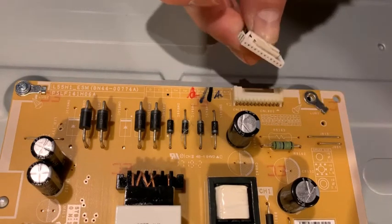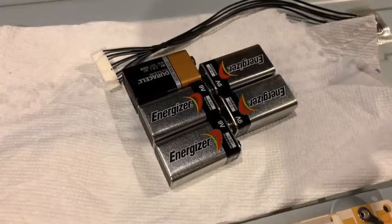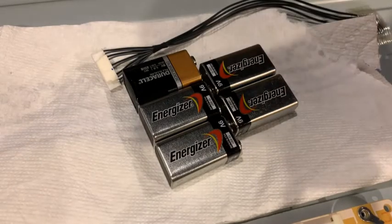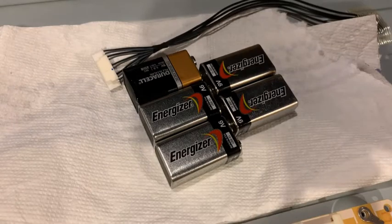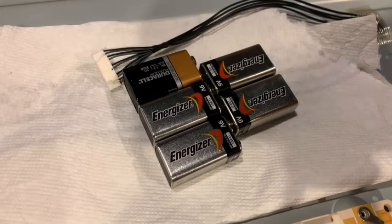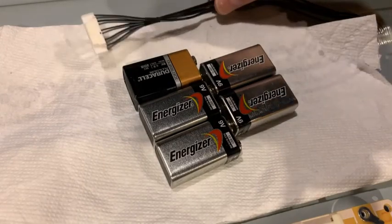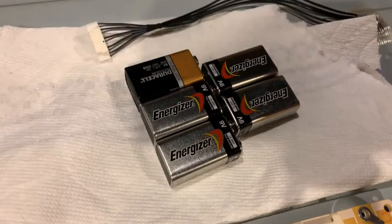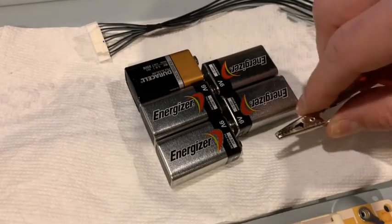Check each and every strip by itself — this way they are now all separated. The way I do this is rather simple. I don't have a power supply I can easily control with that much voltage, so I have five 9-volt batteries connected in series, giving me about 45 volts, which is enough for one of these strips.